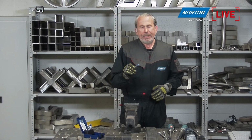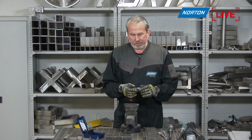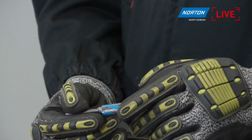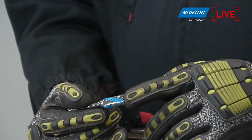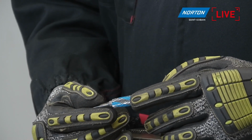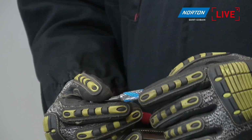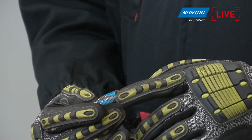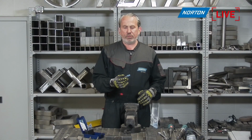Good to know. Okay. And one thing, a question when I first saw these, Paco, was the blue stripe on there. Often, when people use these products and the blue stripe is worn away, they think that the carbide burr is actually dead or gone because that blue color has gone away. Now, the color has nothing to do with the performance of this product. It's just an enhancement to show you that this is a high-performance carbide burr. So it doesn't aid you in any way, the color. It's just to differentiate it in the market from a standard double cut. It's very difficult to see the tooth geometry by just looking at it.